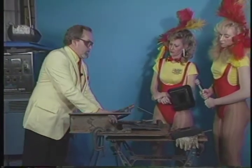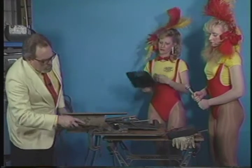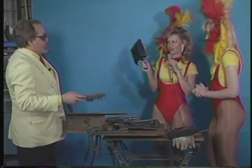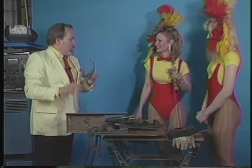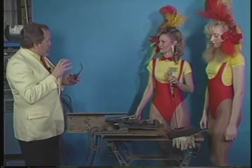And after you do that with a chipping hammer, get the most of it off, you have to come back and wire brush it. But there's still an awful lot on there. If this is something that's going to show, you have to do a whole lot more work. Right. It's what I call fast and nasty welding. It's fast, it's strong, it's economical, but it's not really the prettiest welding in the world.